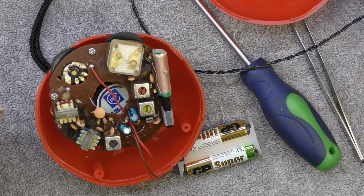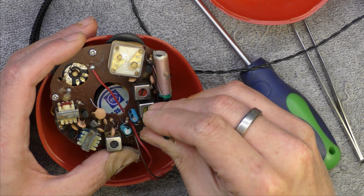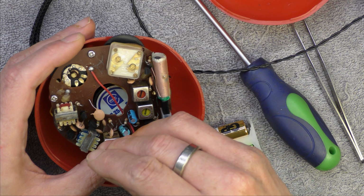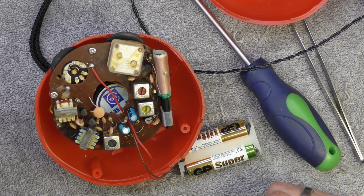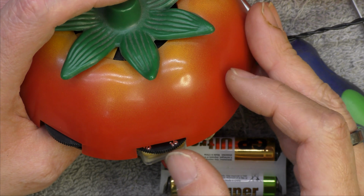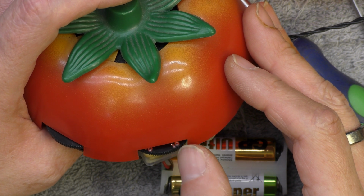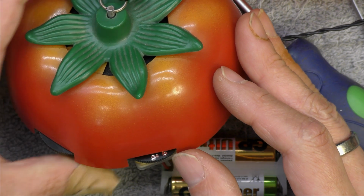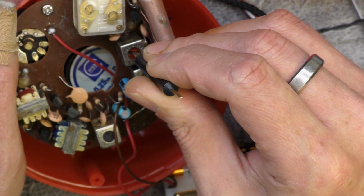Decided I am going to do a quick alignment. I'm going to just guess that this is 455. I'm just using my ear. You won't hear much difference with the automatic gain control of the camcorder. I find it quite difficult to determine the markings on here because 1600 only just comes out here where I'd expect it halfway, so I'm going to take that position and say 600 kilohertz is there, and I'll adjust it according to that. So adjust the oscillator.